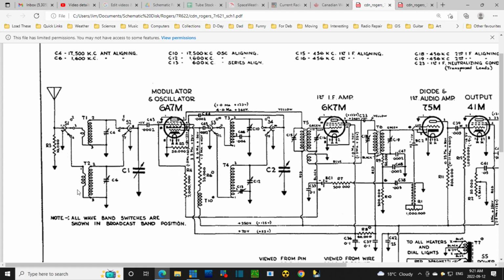It's not obvious, but the AM broadcast band actually ranges over a large change of frequency. The other bands, not so much. Some hardly at all, like the higher shortwave bands. Relatively speaking, you're hardly changing the frequency as you tune through them. But on the broadcast band, you're going from 500 to 1500. That's a factor of 3. So trying to make these things provide some kind of resonant benefit that crosses the whole band is a little tough. So one way you do that is you don't make this very sharp, a very high Q.